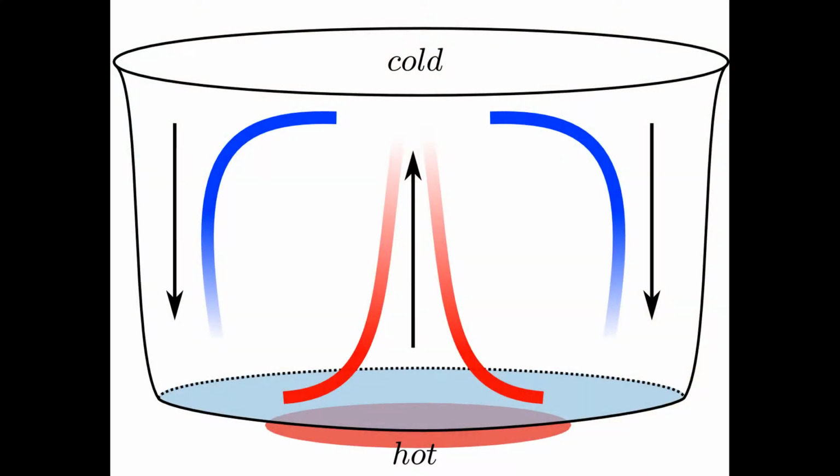And that's because in natural convection, when a quantity of air becomes hotter, it is lighter than the air that surrounds it, and because it's lighter, it moves up. And of course, the colder air tends to move down, thus generating what is known as a convective cell. Now, since there is no weight in microgravity, there is no lighter and heavier, so if a piece of equipment is powered on and nothing is done about heat, then the air that's around this piece of equipment, if it's inside, will just get hotter, and it will not be replaced by colder air.